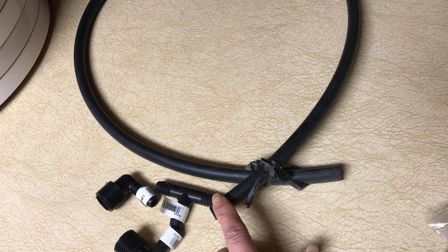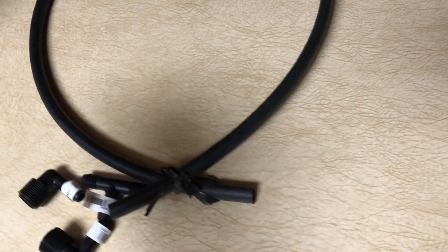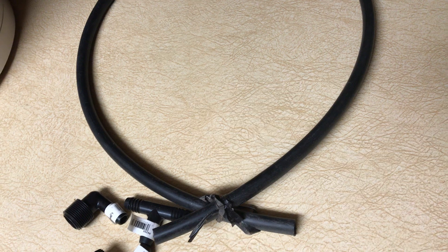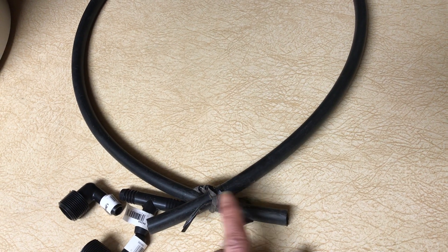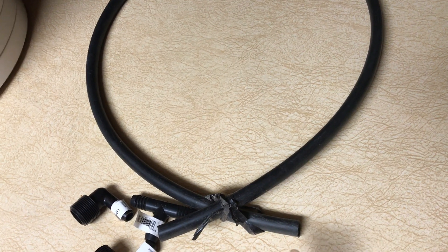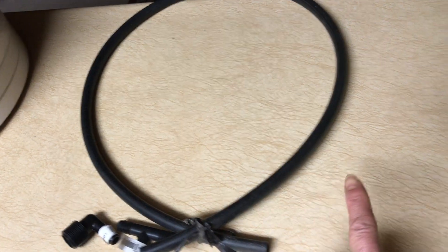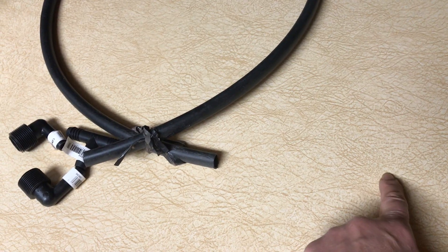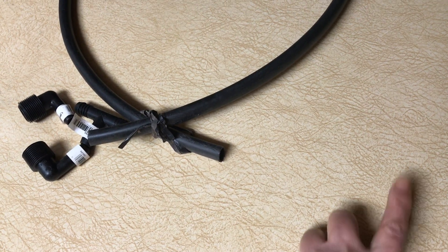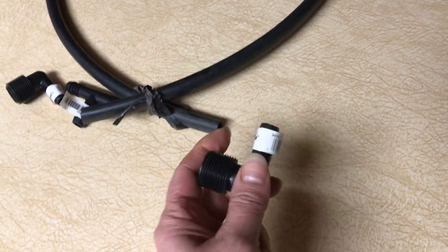Once everything is attached, you can put the sprinkler on that you want at that same place. Then you attach this longer flexible funny pipe — that way you don't have to dig down as deep — and run it across the yard however many feet you need. It comes in large coils. I use this flexible funny pipe when going across a large area so it's more flexible and I don't have to dig as deep. I usually dig deep where the sprinkler is, very shallow across the yard, then deep again where I want the new sprinkler head flush with the grass.